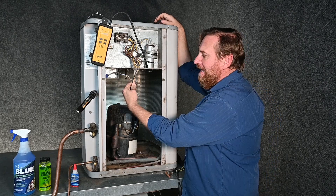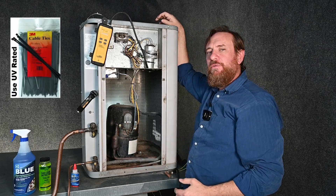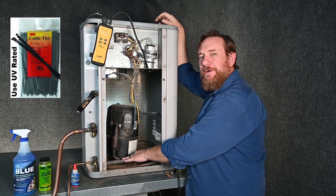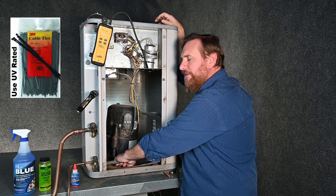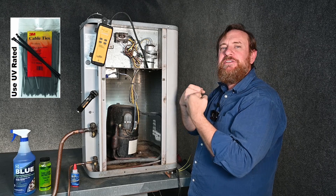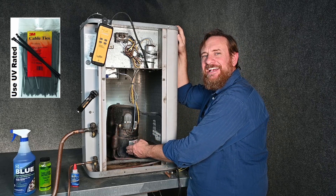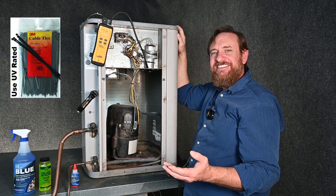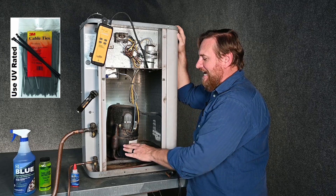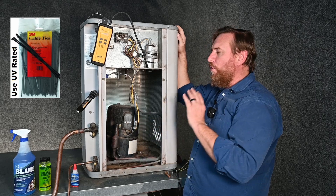Now if it is rubbing, we have two options. We can cable tie the wire together so it's not rubbing against anything. In other cases, we don't really have a choice — it's going to be right up next to a wire somewhere. So what we can do is put a piece of tape, preferably a type of foam tape, against this copper tubing, and then cable tie that wire straight to that copper. By cable tying both together, they're tightly pushed against each other so they're not actually moving and rubbing, so they can't put a hole in it. If you do that method, make sure you're not doing it on the discharge — the hot gas line — because that line gets very hot and can still cause a problem with your wiring. Keep wires away from the hot gas line, and if you have to touch one of the piping, put some insulation between it and cable tie it together so it's a nice tight connection. It works wonders.